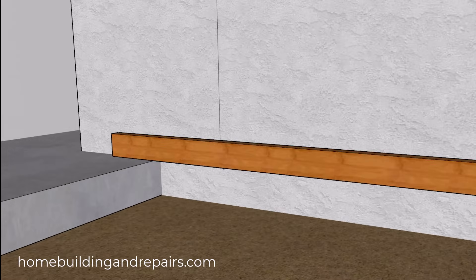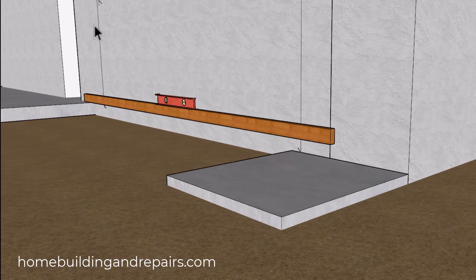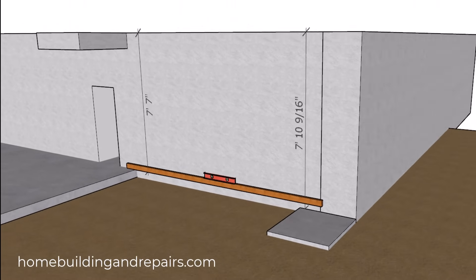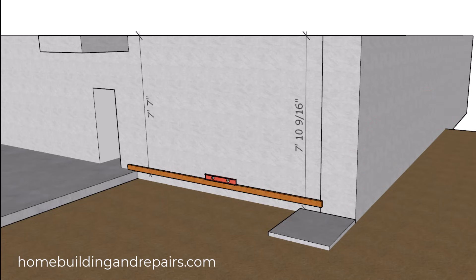You can simply make the adjustments by measuring from either the top or the bottom of a straight edge like a 2x4, and then subtract or add the difference to this measurement to get the overall total rise. You need to calculate the individual risers so that you can lay out your stringer correctly.